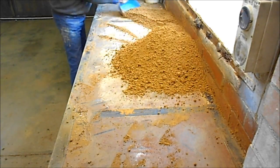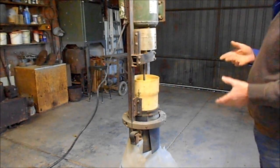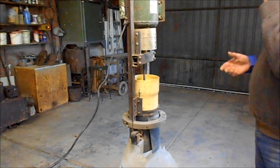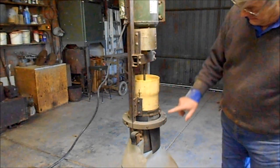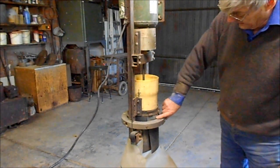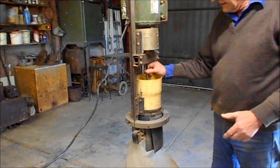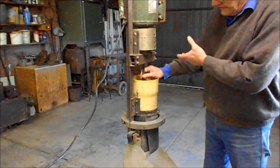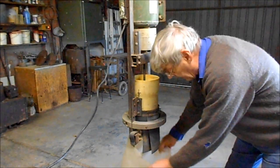At this stage I'll add what's left over from the last brew I mixed. This is the machine I use to break the sand up — it aerates it, mixes it, stirs it. To some extent it probably substitutes for a muller because it does stir the sand around and it does rub the sand against itself quite a lot. It's a half horsepower motor at 1500 RPM. On the end of the shaft there are eight rods that stick out radially, and there are another eight just down a bit lower. Those obviously rotate with the shaft and the sand has to pass through those. There are six stationary rods mounted around at this level, so the sand has to go through eight moving rods, six stationary, and eight moving — this makes certain it's well beaten up.